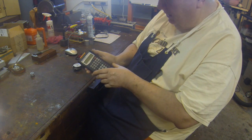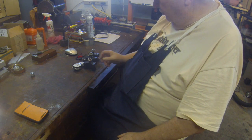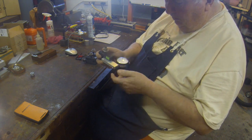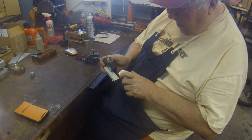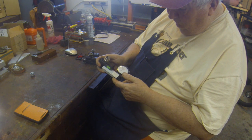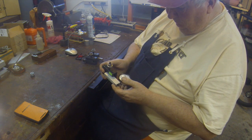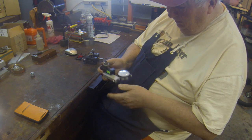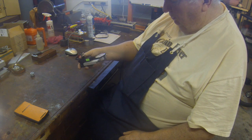So it's proved to be very handy to me, and they're not all that expensive, and I keep it here on the workbench all the time. Some of the other tools that I made for the lathe, this is a BXA tool holder with a little piece of flat stock in it, cross drilled to fit the diameter of the plunger sleeve, and you can see there that it would measure. I use it for checking concentricity of parts on the lathe. I've got a little bit too big of a set screw to hold the sleeve in, but anyway, that's one of the parts that I built. Took no time at all, and gives a very steady mount on the tool post for an indicator.